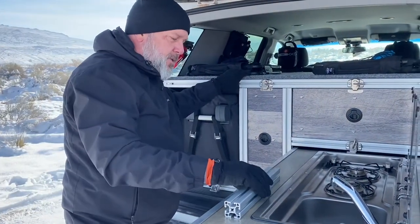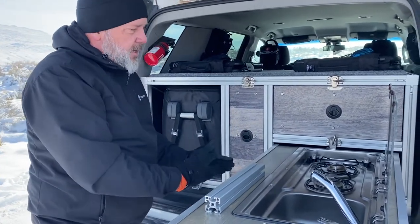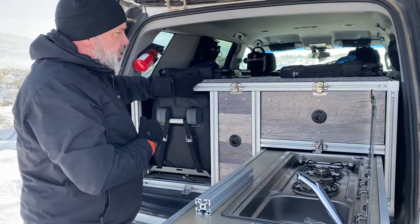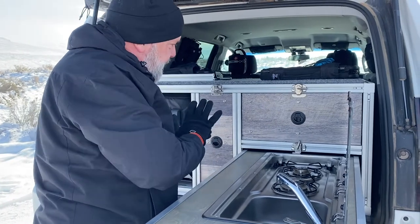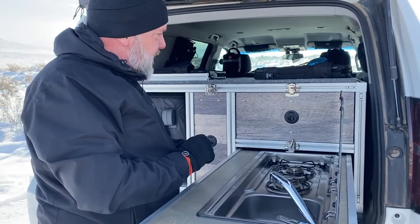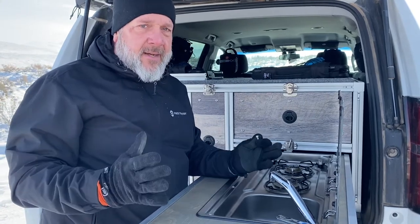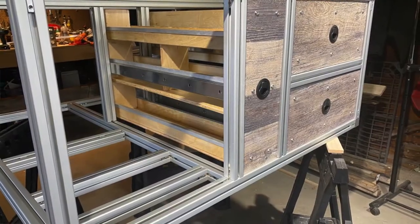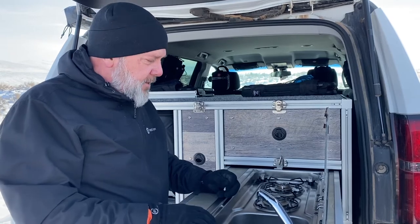The design was to use as little of the extruded aluminum as possible because of the expense, and to find other types of hardware that could serve dual purposes — both holding things like the cooler and making the whole frame more rigid. You can see there's no movement to it as it's bolted in. One tip in assembling this: don't tighten anything down until you're ready to tighten it all down for one final squaring. Keeping everything loose gives a little leeway, and then once it was all done, I took a square to every corner and tightened everything down.